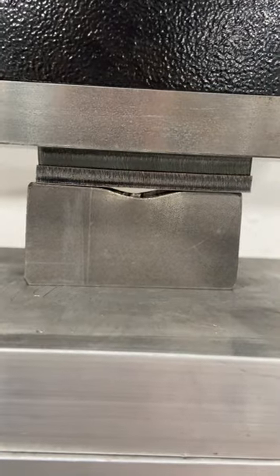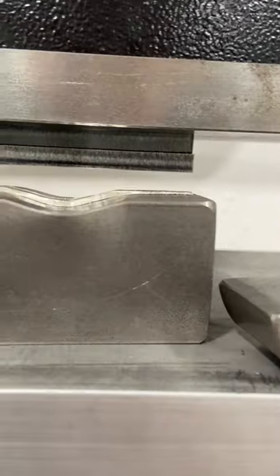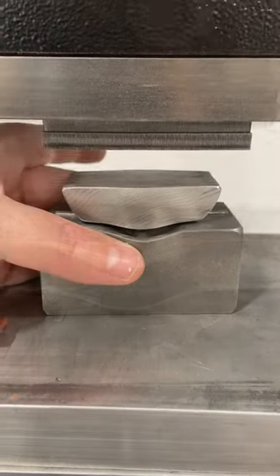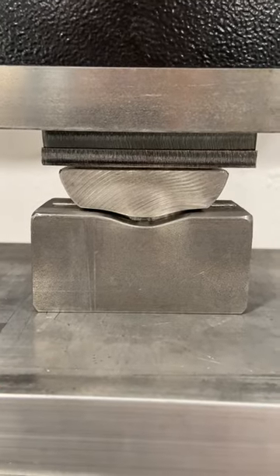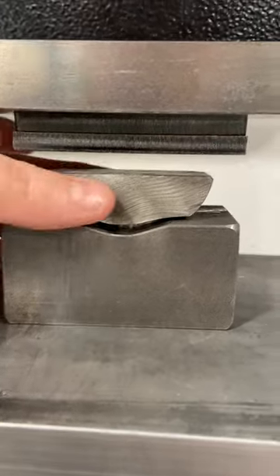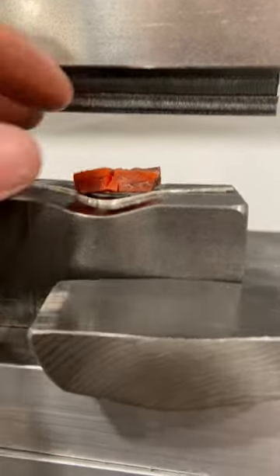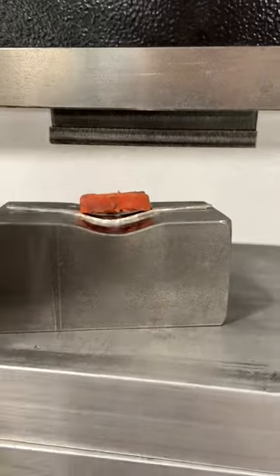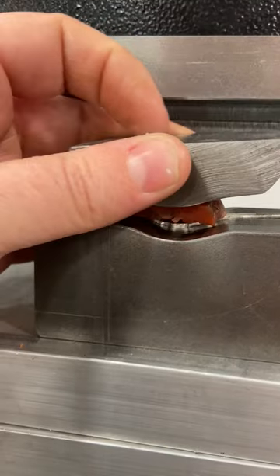Here I'm just pressing the shank portion of the ring, and now I'll focus on the central portion of the ring. Again, using the humpback ring kit, that specialized pusher conforms right to the shape of the ring. So this is concentrating the force into the area where I'm placing the urethane, because I'm trying to pick up the detail in the center of the ring.